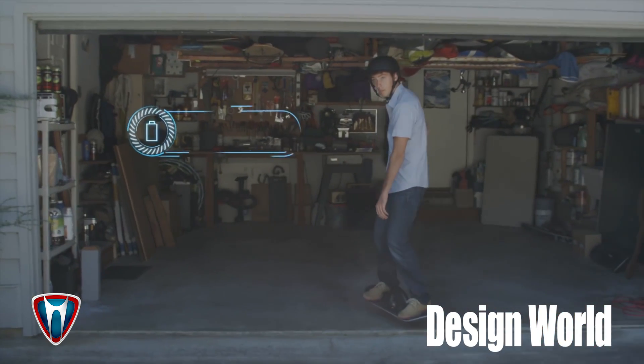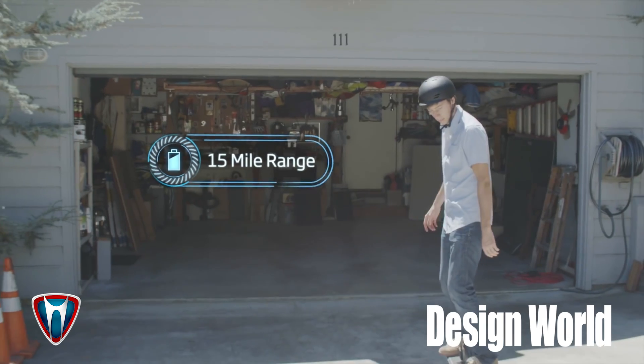I noticed it has lithium battery technology, but it's not really the same lithium chemistries that are giving other hoverboards a bad name. Tell us a little about that. So we use the slightly more expensive stable lithium iron phosphate chemistry. We also wrap it with very contemporary monitoring and balancing electronics to monitor the temperature of each individual cell and the voltage of each individual cell, making sure they're always perfectly in alignment.